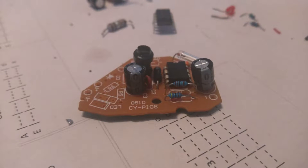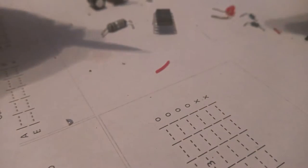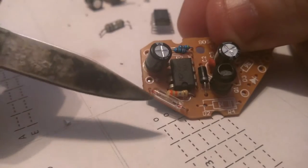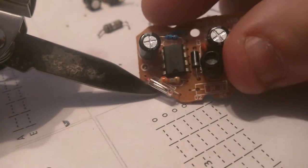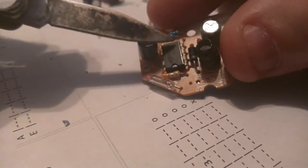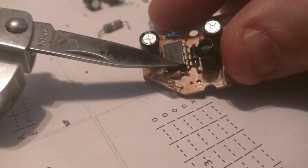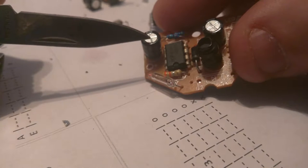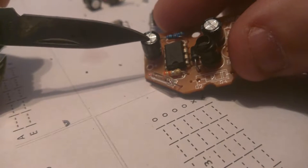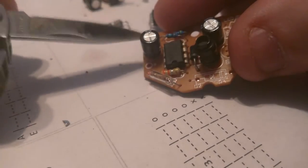We've got ourselves a non-replaceable fuse. Well, non-replaceable if you don't know what you're doing. We have the actual chip, our boost buck converter. We have a 47 nano, 35 volt capacitor. Yeah, this was designed to be in a car, so it's got to have the range.